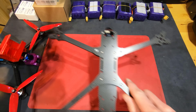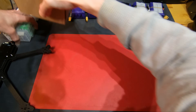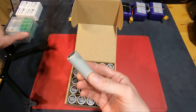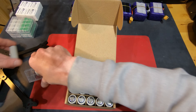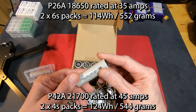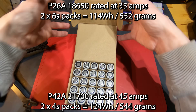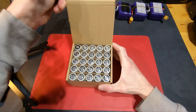For the 4S batteries on this new frame, I'm going to make them out of different cells — still Molicel, but P42A 21700 cells, which are a little bigger and heavier than the 18650s. I'm going to see how two 4S packs of these work; it comes out to about the same or slightly more watt-hours than two 6S packs of the 18650s. It'll be interesting to see how the efficiency comparison works — it's going to be a lot of work making all these batteries, so I'll probably do a video about that.